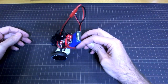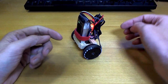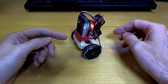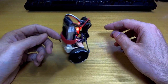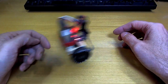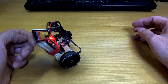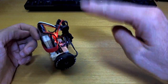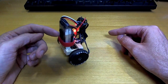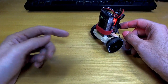This is the best I've managed to get at this point without a proper rewrite of the code to handle the fact that the whole thing is accelerating to one side or another. If I tap it one way or the other it just keeps accelerating in that direction, because it's not preemptively adjusting its angle to account for actually tipping over — it's just trying to straighten itself up but not doing it quickly enough. I don't think the PID settings alone are going to handle this, so that's as far as I'm going to take it for now.